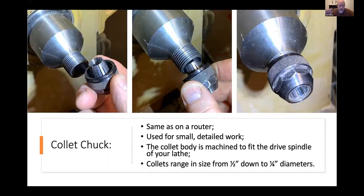This is a collet chuck. The main thing about a collet chuck is you want to make sure that your dowel portion of your work piece completely fills the collet, so the collet is gripping wood all the way down. I like it to be anywhere from an eighth to three-sixteenths proud of the bottom of the collet — then you get a good grip all the way around and you don't get as much vibration. Sizes range from half inch down to quarter inch diameters. You can get them smaller for jewelers' lathes down to sixteenth of an inch bits.